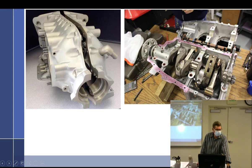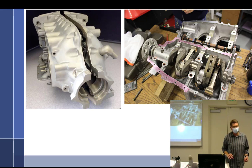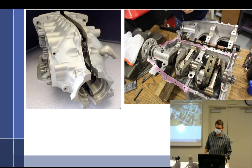So you obviously have it anchored on one side. And with floating, there's a couple of things. One, that's where it becomes so critical to torque both sides of them. I think I told you when I built engines, my buddy Nathan, who I worked with, I'd always call him in, and it was like a little dance. We could do it. I love working with that guy because we just get in sync. It's next. We know which one, and click, and we both click about the same time. And we go through the whole sequence and make sure everything was torqued simultaneously. Not me doing this side, then walking around to this side. We literally calibrated torque wrenches, both sides at the same time, and checked them all.